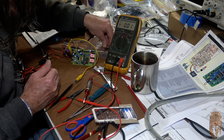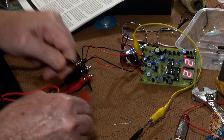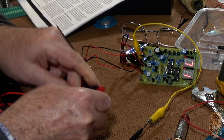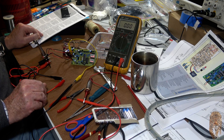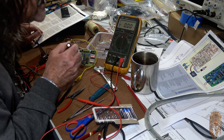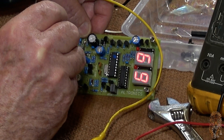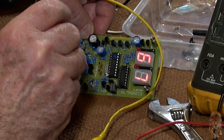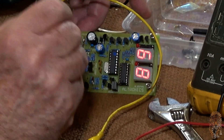Connect the supplied 68-ohm resistor. We put the probes on it — it's measuring 71. We adjust VR2 until we get 68. VR2 is this one here. 68 — beautiful.